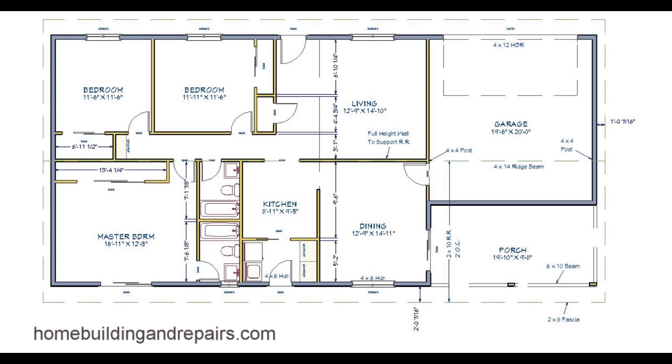It's probably going to have all the shear panel and headers — any type of structural members might be on this plan. Sometimes you are going to have a roof plan and a structural plan, but in this one I'm actually going to combine the roof framing plan with the structural plan because there's not a lot of structural information. There won't be any details on this particular plan, as adding too many lines everywhere would get confusing.